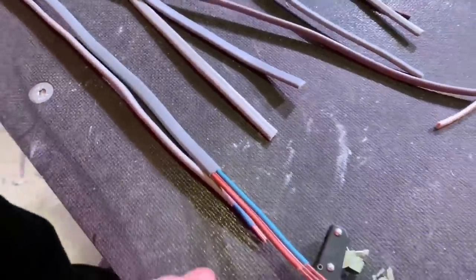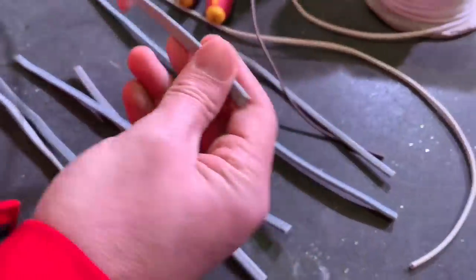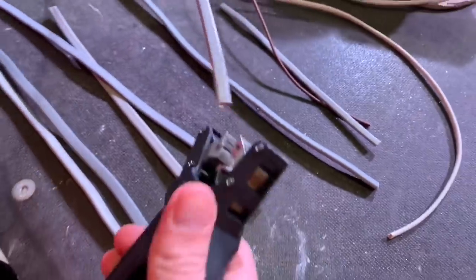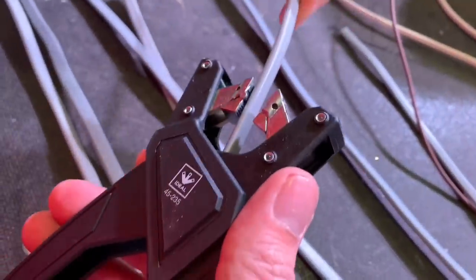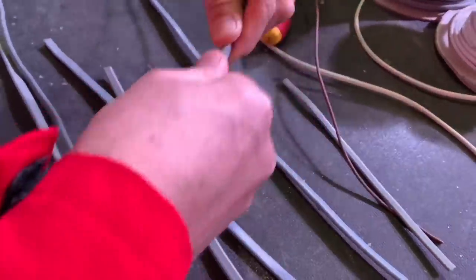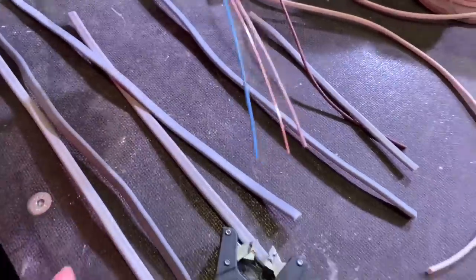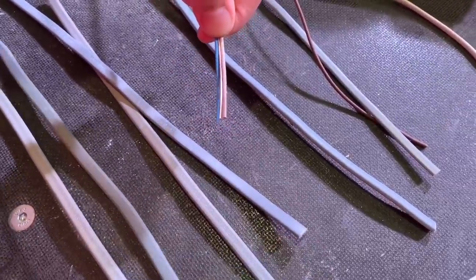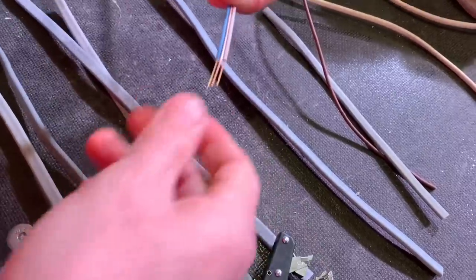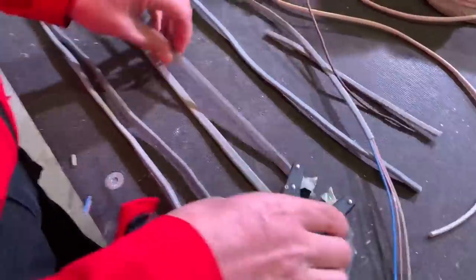That's the 2.5mm² cable — up to 12mm diameter. Now let's go to the opposite end of the twin and earth spectrum. Going for 1mm here. Slip it through — for lighting you might have a longer strip length required. The ease of removing the outer is clear; there's virtually no chalk in the cable. Go back in for the conductors — look at that, doing both at once. That's a real time saver.